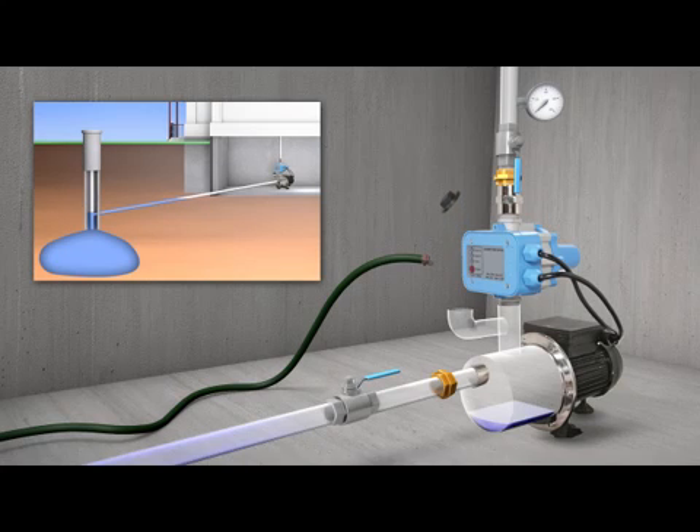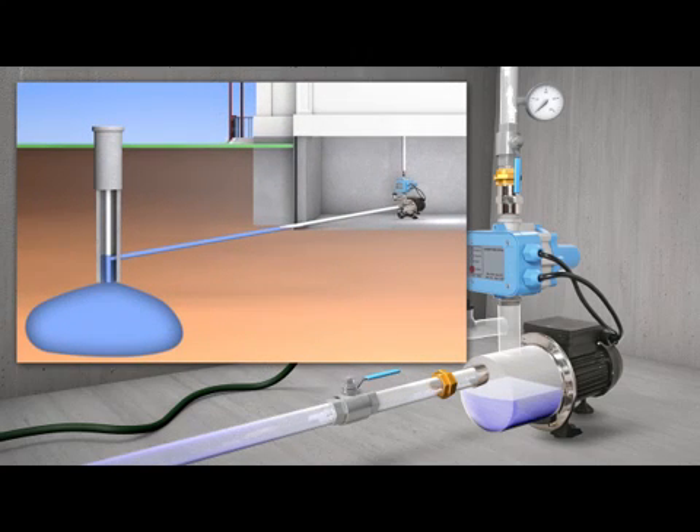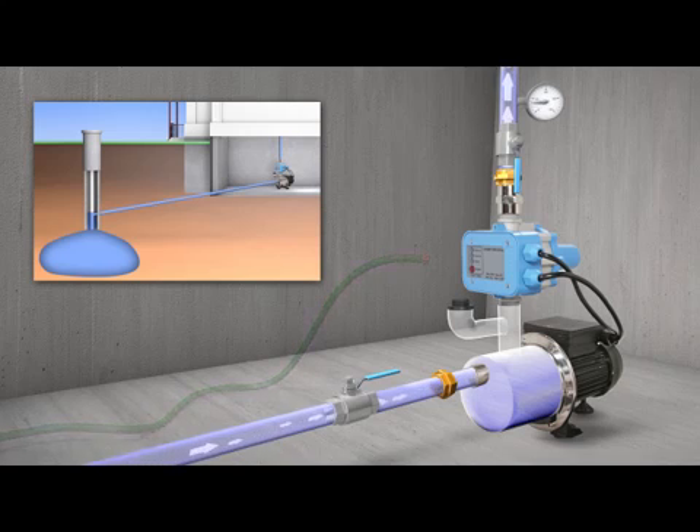It is normal for the flow switch to turn off the motor when the pump hits an air pocket. Refill the housing to full capacity and restart the pump. It may be necessary to repeat this process several times depending on the length of pipe coming from the well. As soon as the pump is running consistently, a constant supply of water will be available to your system.